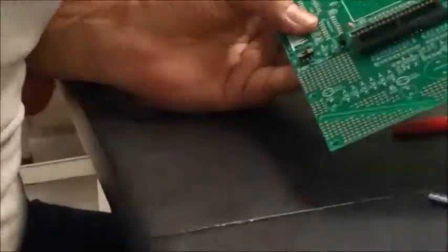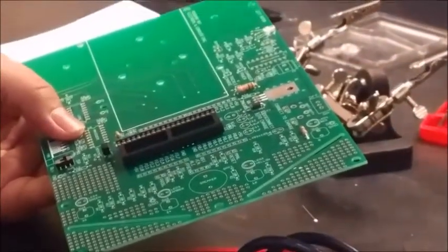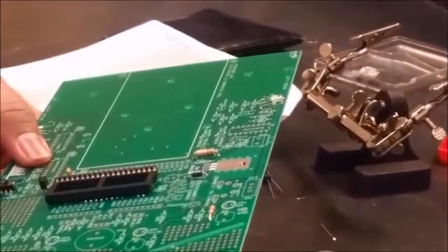It should be, these 2 pins are, oh, this is for A and B and C. Huh. Oh, connected here. Sorry, it's not labeled as U. Okay, with these 2-pin connectors, what we need to take care of is the longer side stays up. So we have to solder this other side.